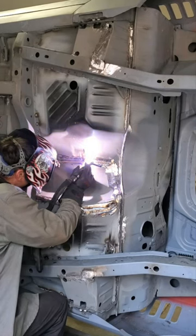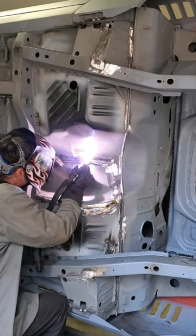This makes it ideal for joining thin metal together or for filling areas where you would want to be using seam sealer, as seen in this 4 speed tunnel. This is a weaker weld, so do not use it in high stress areas, especially not chassis and frame construction.